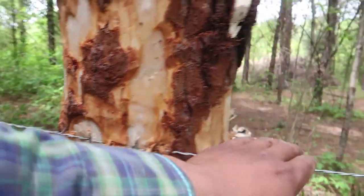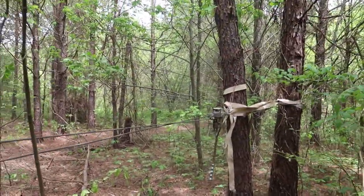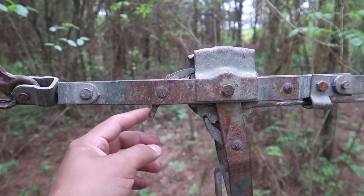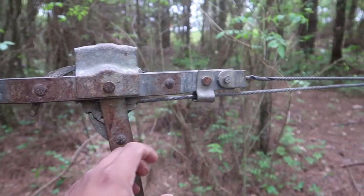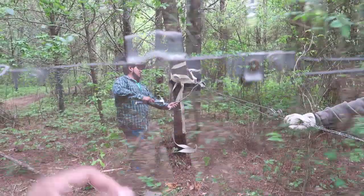We like it. Now it's time to undo this come along. Check it out. So you have this little clip right here, all right? That's gonna be your clip that we're gonna hit with a hammer right now. Step away, be safe, and then that's gonna release the tension on this come along. All right, check it out.